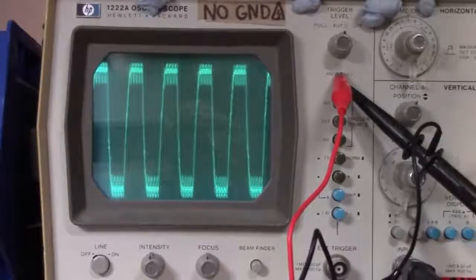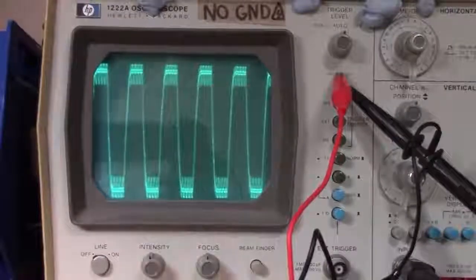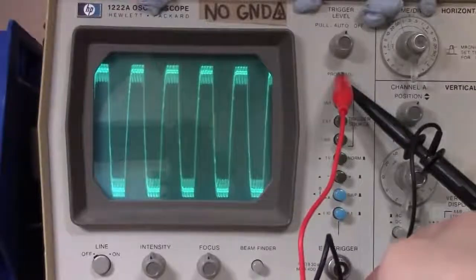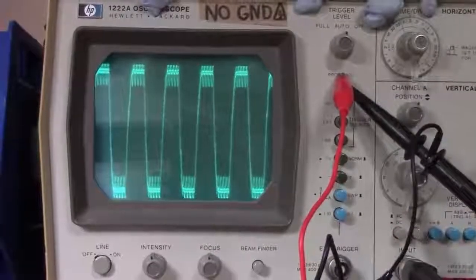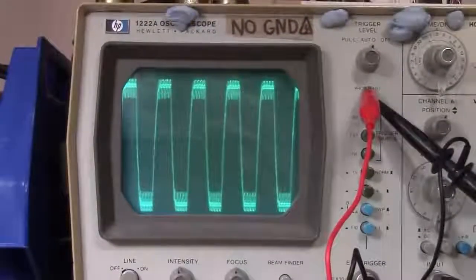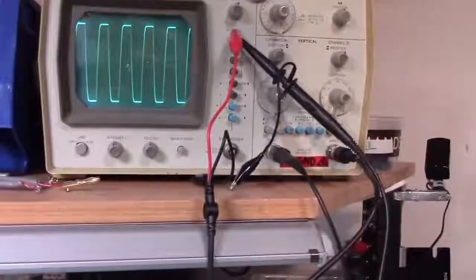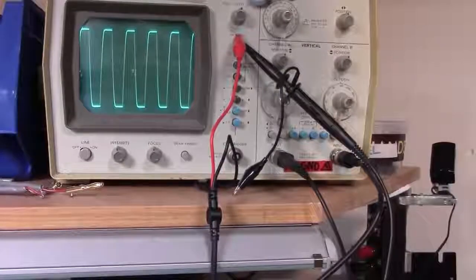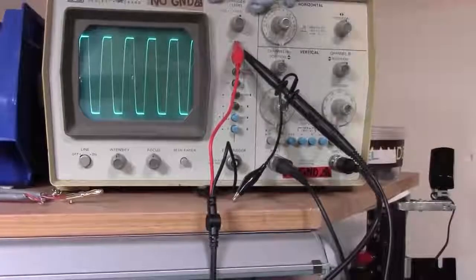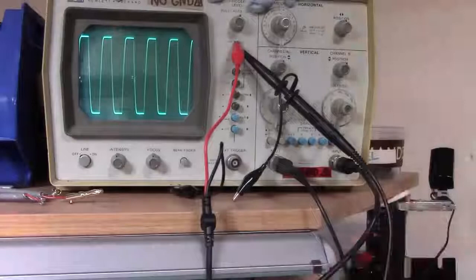We get enough interference entering the probe to actually upset the quality of the input signal. It doesn't matter which probe we trigger on — we still get noise, because I've got a light fixture nearby. If I just flip that off, everything is fine. So it's not the highest fidelity probe, but it'll probably do for really low frequency stuff and really high voltage stuff. Although it is a times-one probe, so I would not feel comfortable putting a lot of voltage into it.